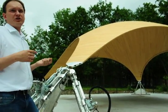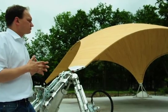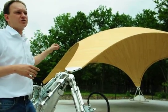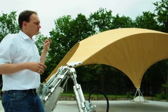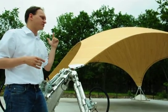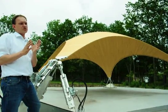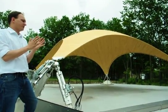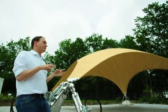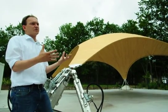Those two things — the redistribution of the stresses and the vibration control — allow us to build a structure that you actually can't build with just passive means. You take out material, but you use energy through hydraulics. The problem is with structures: when we design a structure, we design it for a 50-year load. So for most of their lifespan, structures are well over-designed. You actually need all this material only once — when you have a lot of snow and there's a bad storm. But since that happens only rarely, we still have to design for it. So for 99.9% of the time, the structures are over-designed, and for 0.1% of the time, they're actually designed to what they need to do. What we're saying is: we take out all this material that we don't need most of the time, and we replace it with energy that we only induce at the times of maximum loads. The energy that we provide to the system is temporary, and we take out mass or weight of the structure permanently.